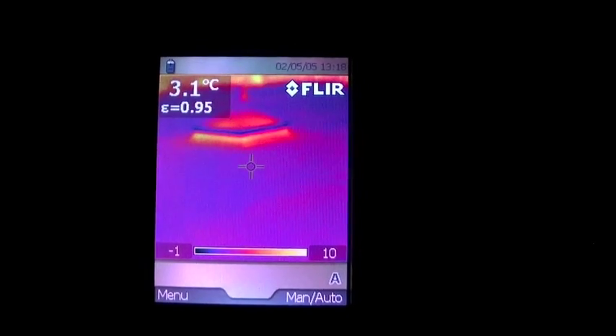Here we are up on the roof at night and as you can see it's pitch black. You can see the city lights but you can't see the roof at all. Here's the infrared camera — just for reference, what you're looking at in the picture there is a skylight and see how it's giving off heat. Let's do a quick scan of this roof and see how much leakage they have. There's some color change here — there is some leakage right there. We're looking at a drain here that's giving off heat, and right beside the drain you can see a line, and this is actually where they're getting a leak.